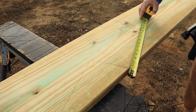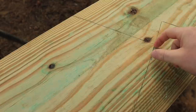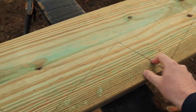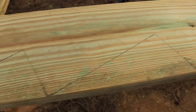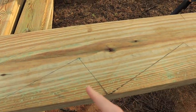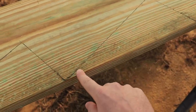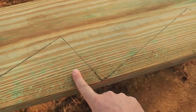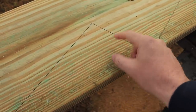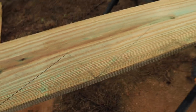And one thing that I always found confuses some people, he explained how we subtract the 3 inches from the backside here because we're going to be putting a backer on the back of all of our stringers, and then we're going to be building out the fronts, connecting them with 2x material. So some people get confused. Hey, shouldn't I subtract 1.5 inches off of each tread because I'm going to be adding a 2x to the front? No, because this right here is 13 inches. We're going to be adding a 2x, so you would think, okay, now it's making it 14.5, but no, this one is also getting a 2x, so we're basically subtracting 1.5 inches off of this tread, and then we're adding it here, so everything is going to line back up and be good.